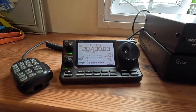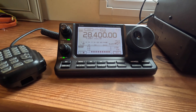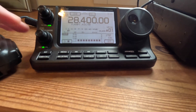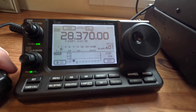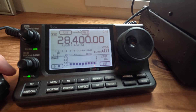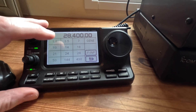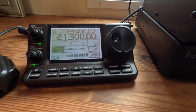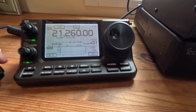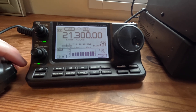It's all up anyway and I thought I'd just check the SWR before we go any further - we'll go through the three bands and see what we've got. I've got it somewhere near where I play, which is around 28,400. You can see it's creeping up and we're under 1.5, about 1.4 - so that's fine, we're okay on that band. Moving over to 15 meters - she's creeping up a bit too much there really.